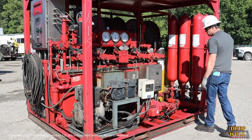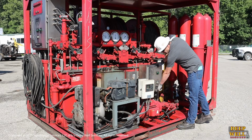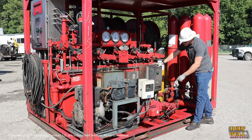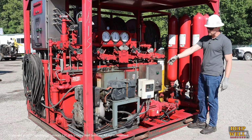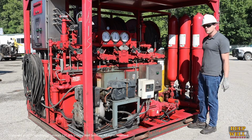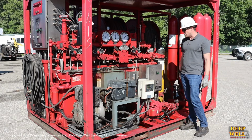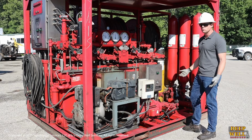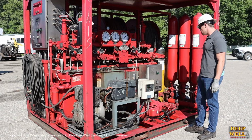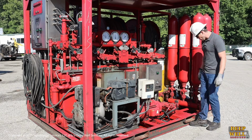While we're over here, if you look down on the floor closer to the tank, you'll see suction valves where the fluid gets drawn out of the reservoir tank and into the pumps. It's rare that those would be closed, but it is something you can check to make sure those suction valves are open. If they weren't open, the initial build-up test wouldn't have passed. So it's usually a pretty good indication that they're open, but it's worth checking as well.